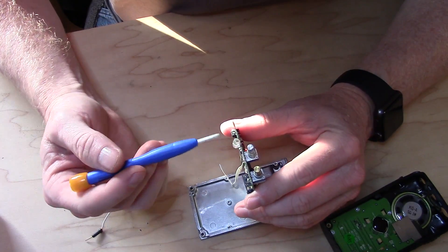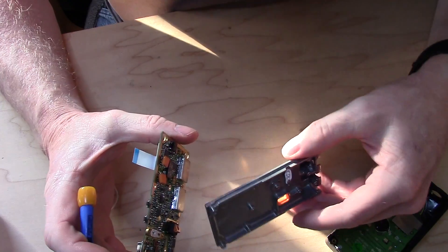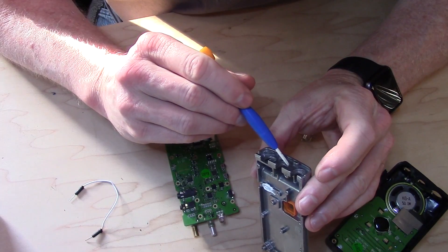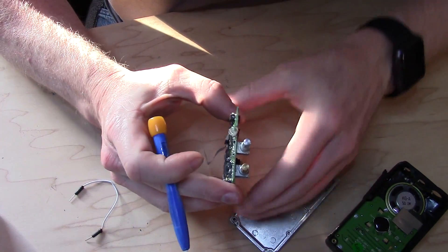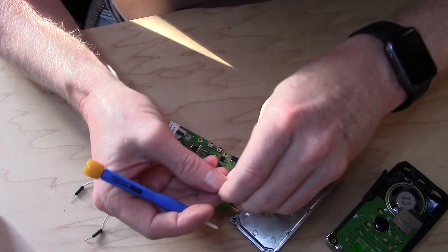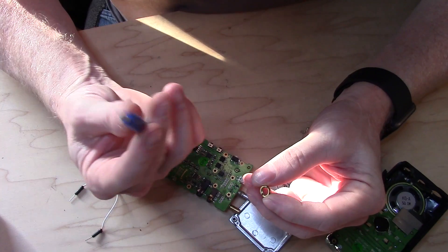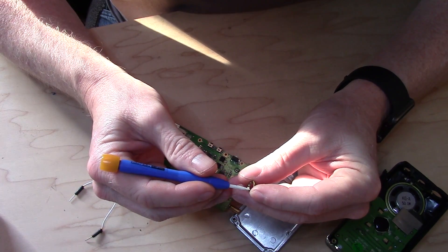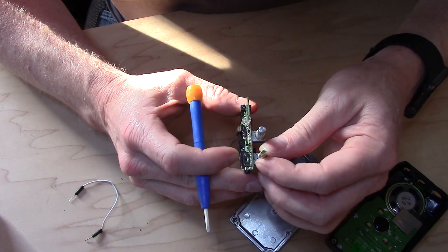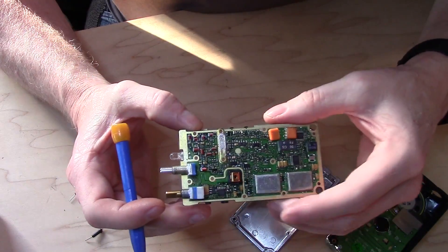One other thing I wanted to note: this radio is actually really well put together. This edge of the board fits exactly flush with the case. If you notice, these are kind of scalloped there, and these actually do have a brass retainer. Let me grab one to show you what it looks like. This is what the brass retainer looks like. You can go in with a screwdriver - you'll probably use a metal screwdriver - and just rotate these around to get them up. But that board will not come out until you take these two off. Other than that, that's really the only painful thing about getting one of these apart.